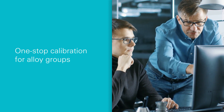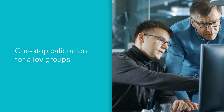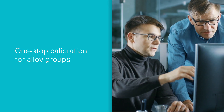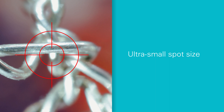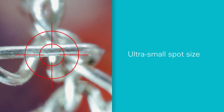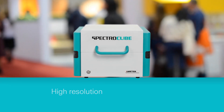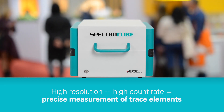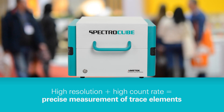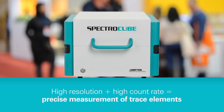Forget setting up separate calibrations or remeasuring for specific alloy type groups — for most precious metal samples, SpectroCube needs only its baseline calibrations. On jewelry large or small, SpectroCube can analyze an area down to a spot size of 0.2 millimeter, one of the smallest spot sizes in the industry. SpectroCube can correctly identify and measure even minor and trace elements in precious metals alloys — especially for jewelry gold, silver, platinum alloys and more — giving you a precise accounting of every single sample.